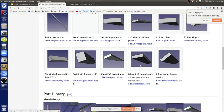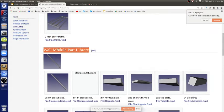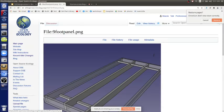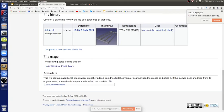We've got the top and bottom plates, the vertical studs, and the blocking that goes in between, where, like in this picture, the blocking is attached so you can attach the sheets of 4x8 plywood to the front and back. On the interior, there's the utility channel where all the electrical is going to run. We're simplifying the electrical by allowing you to run wires in a cavity that you have ready access to, with a constraint that you also have to pass codes, because we're not doing the standard drilling of holes through studs. We're just using this utility channel like a modular structure for all the electrical.